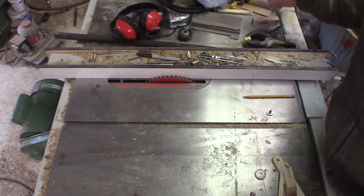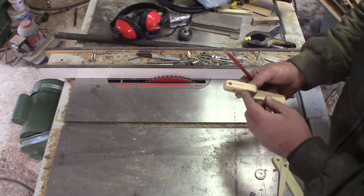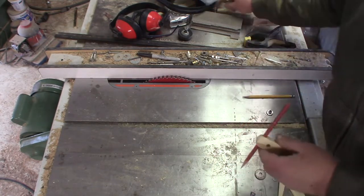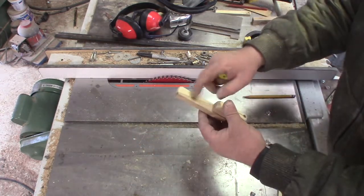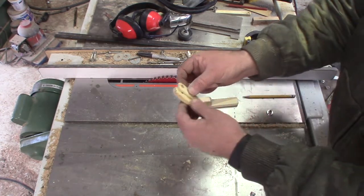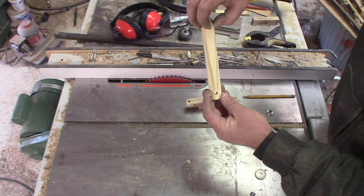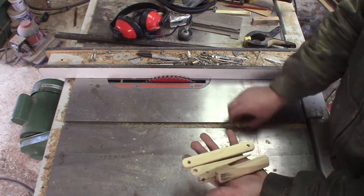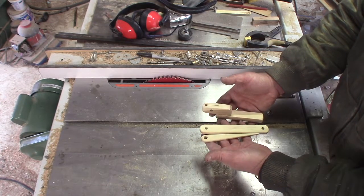While the main scribe is drying, I made some more parts. So this is the pencil holder — you can see it's just a stick slit in half, it's got a screw hole through it, pencil fits in there, and then I got a wing nut that will tighten up right there. I have not yet drilled the center line hole but that's coming too. And then I made up the parts for a pendulum — a pendulum will help make sure you've got this thing reasonably straight up and down. I'm going to go ahead and spray all of those, because they are now ready for a coat of finish, and if they don't get something they'll probably warp. Then we'll do final assembly and fitment.